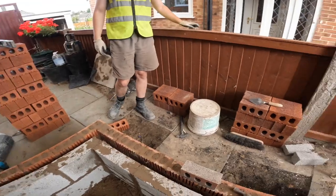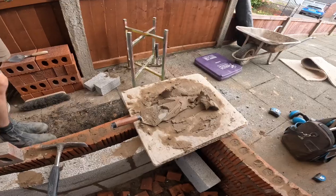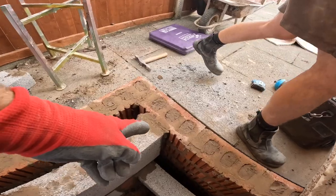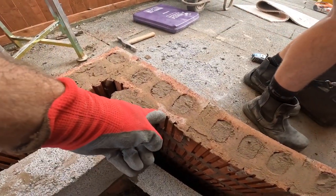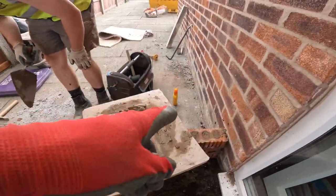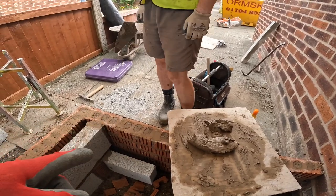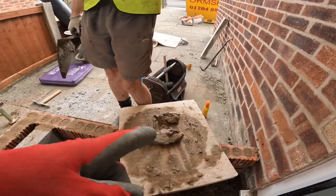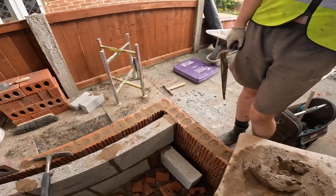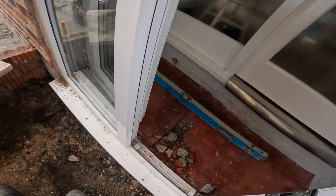Yeah, I'll have to load out there. There's 100 bricks to go on this side. And this side is just a 270 nib. Just lift that board up, please, mate. So the 270 nib is slightly bigger than our block work, but that'll give room for plasterboard. So that's just straight up. There's our nib, the pencil mark. So we've got a window frame, door frame. A bit of rain. Window frame, 200mm, door frame, and then that. That's how it works. So, yeah, we'll put them up while I break this floor and chuck it in its hole.